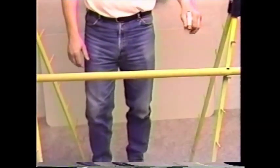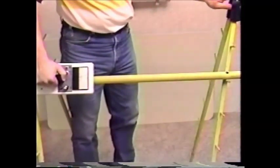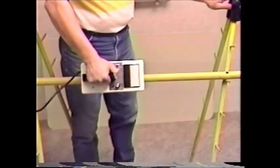However, visual inspection is inadequate to determine how the tool will perform during the wet test. As the stick is wetted, you will note that the water doesn't bead as much as the first stick. Placing the tester on the tool, we will note that not only does the tool fail the test, but the meter is going off scale.